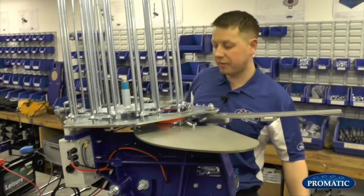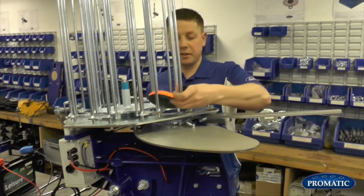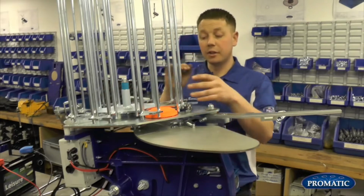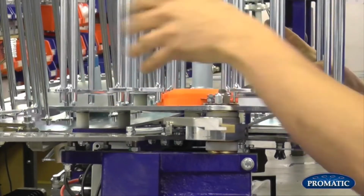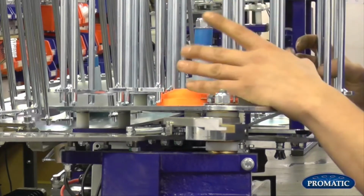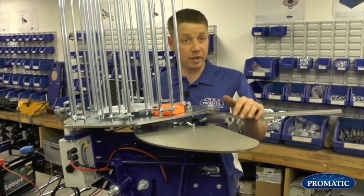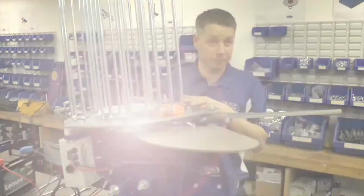One of the most common faults when people set a knife edge is that they think the knife edges are designed to touch the clay that's actually due to be thrown. The knife edge is designed to take the one off the top. The actual bottom one doesn't want to come into contact whatsoever. So as the bars on the carousel are pushing the knife edge through, you don't want the clay that's just about to be thrown to come into contact at all with the knife edges. If it does, it's going to crack it or take a chip out of it, and of course when it actually comes to be thrown, it'll more likely come out as a no bird. So one of the most common reasons why a trap will break clays is the knife edges are set incorrectly.